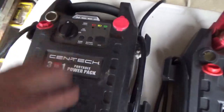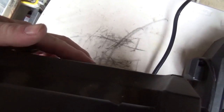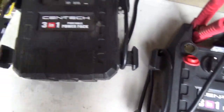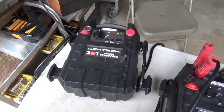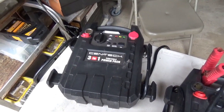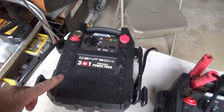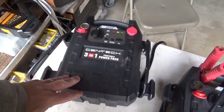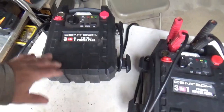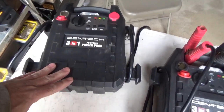It turns out these things have a couple of problems. First, if you leave them charging all the time, it overcharges and boils the battery away, which kills them. If you let them go dead, the gel cell either settles, moves, dries out — whatever happens — they won't take a charge. You've got to keep them right at that edge: not overcharged, and never let them go fully dead.